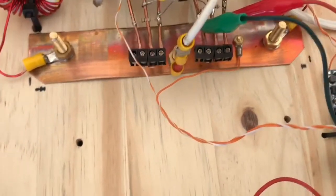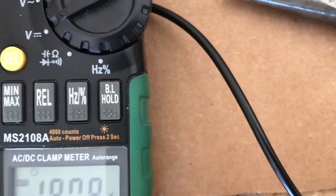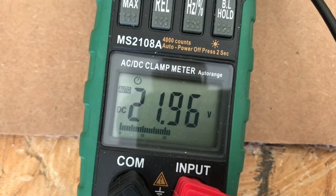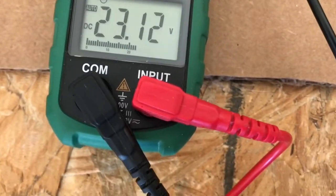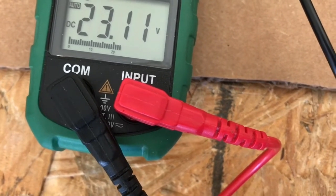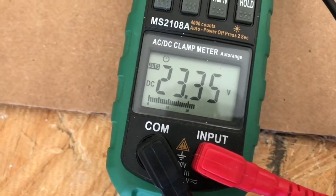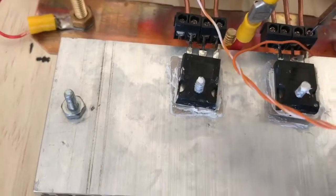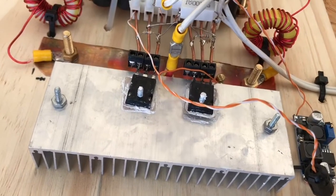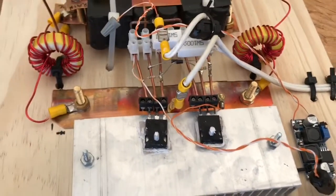The voltage provided to the gates needs to be 24 volts using this buck converter — it has a trimmer on it so you can adjust it until you get to 24 volts. This will go all the way up to about 32 volts, but you don't want to run these IGBTs above 30 volts because it'll damage the gates. So 24 volts is a good voltage where the transistor switches completely. Tighten the new transistors in place and let's connect it up and test it.